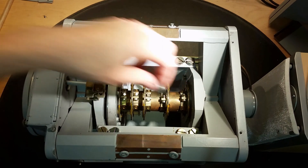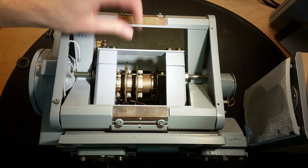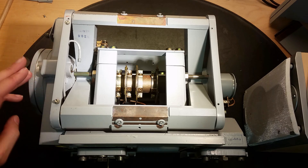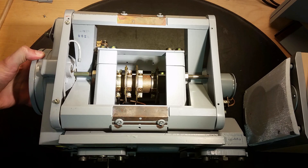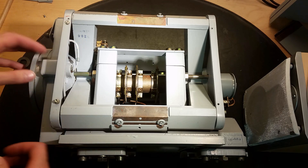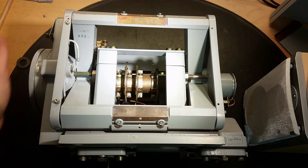There is quite a powerful magnetic field inside of that. Here we got the other side - we can see the rings here. Pretty heavy duty made, pretty thick steel everywhere. Got a signal wire - when you open the lid here, it will detect that and shut the system down, because it's not good to touch like 1400 volts, which this tube is driven by. Pretty high voltage. There are some safety features like this one, and when you remove the cover from the front, you're actually disconnecting the tube. There was a connector on the side of the whole lid that covers this one.